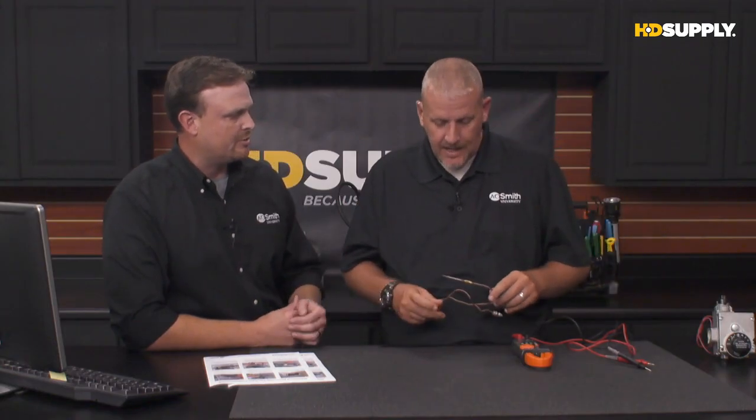And it's a good idea with this test to have some alligator clips on the end of your meter because you will have to hold down the pilot. The most important part of that test is holding down that pilot. It does make it a lot easier if you have the alligator clips that go onto the end. I know you guys can't see this, but the ends of these things are threaded so that you can screw an alligator clip onto these. Makes it a lot easier, unless you have an arm growing right out of the middle of your chest.